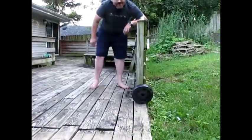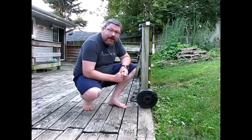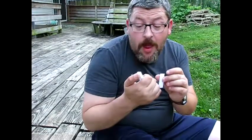It held for a moment — there it goes. It did not quite hold 20 pounds. Since it held for a little while, 20 pounds is probably a good benchmark for the Proto-Pasta stuff. Here's how it broke: you can see it broke pretty squarely in the middle of the infill — it just ripped apart and snapped. This was printed at 45% infill, so it's not solid but relatively solid, and that's exactly the print setting I'll use for all the Proto-Pasta tests.